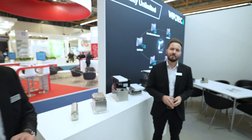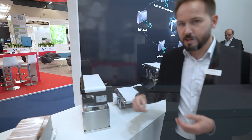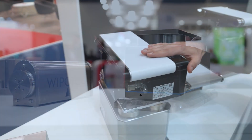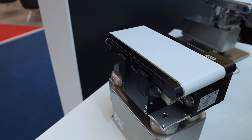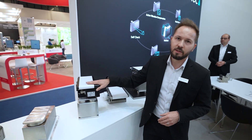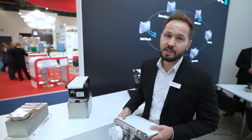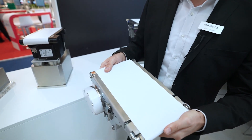Now we move on to give you an overview of more possibilities. Björn will show you the weighing kits, which are weigh cells combined with further components — in this case with conveyors. A weighing kit always combines a weigh cell together with a weighing conveyor, a conveyor especially made and built for that kind of application. What we see here is the ECFS weigh cell together with an NT30 weighing conveyor, which has a protection class of IP54. With exactly the same weigh cell, which comes as standard with IP65, we can add a stainless steel conveyor and easily realize IP65.